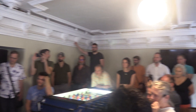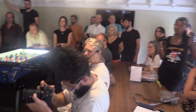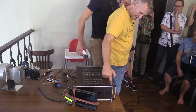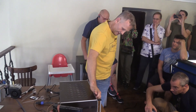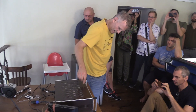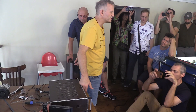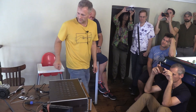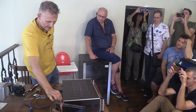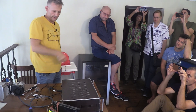This device has two microwave transformer power supplies inside, and it has a method of modulating the input power either from a control system or by moving these dials. It has a preheater for the magnetron, and two switches to engage the high voltage components. There's a big safety cable, and at the back, attached to this clock, there's a BNC connector to a frequency modulator device that chops the power on and off, producing high power pulses.